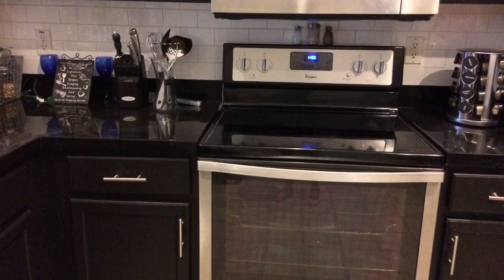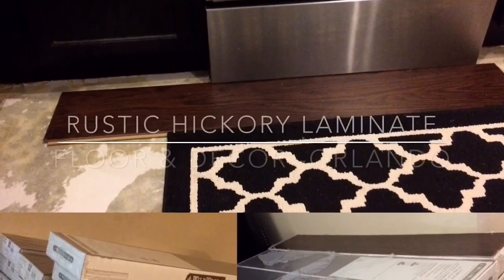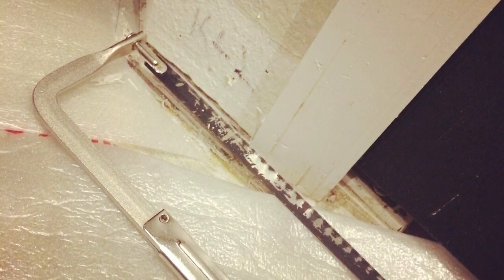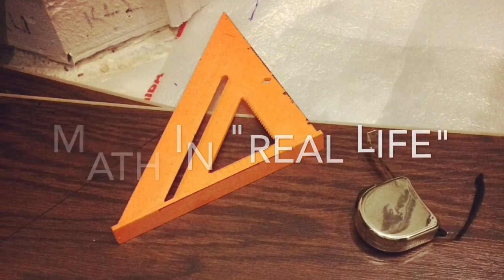Everything except the floors. We're currently working on that — we got our flooring at Floor & Decor in Orlando, the rustic hickory laminate, and we're applying it all ourselves. We pulled up all the nasty linoleum and carpeting throughout the house and purchased enough to cover all the flooring in the home. We took off all the baseboards, labeled everything so we knew how to put it back, trimmed anything that needed trimming, and did all the math and cutting ourselves. And if it weren't for math and my husband's saw work, this flooring would not look as gorgeous as it is — though my knees aren't so happy.